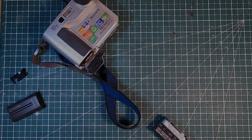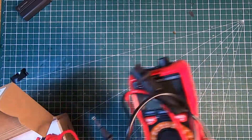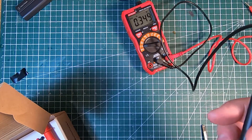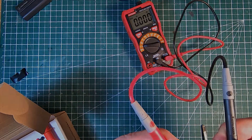At this point there was a lot of cursing and poking things with the multimeter. I suspected the issue was dried out or dead capacitors. Capacitors can lose the ability to take a charge, but you can reform them. For this camera, that basically meant putting the charged batteries in the battery holder and just leaving it overnight. With a lot of cameras, because they're such low voltage devices, leaving the batteries in them for a few hours or overnight will often recondition the capacitors. This doesn't always work — it's not a magic bullet. I've got a few cameras right now where I've tried this and they're still bricks.